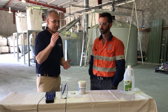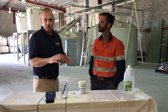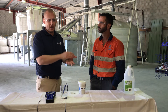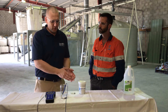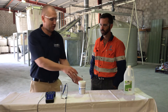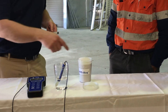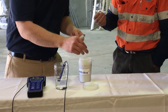So what we're now going to do is the test with our Calix ActiMag product. This is our 60% slurry, and as you can see there are a few differences. The requirement for PPE is not as necessary as with the other product. This is a product that can be touched, can be handled, and isn't corrosive. We've got the same vinegar and we're going to add 6 millilitres to this product and see what it does to the pH. Feel free — you can dip your finger in, it's not going to burn you. All you have to do is wash it off once you're done.